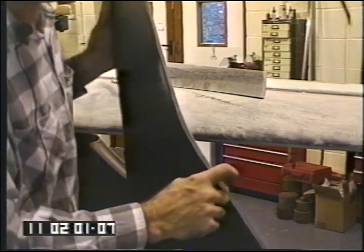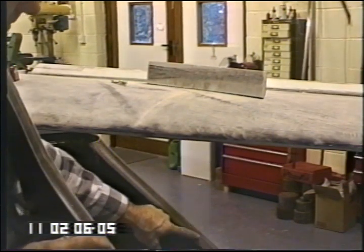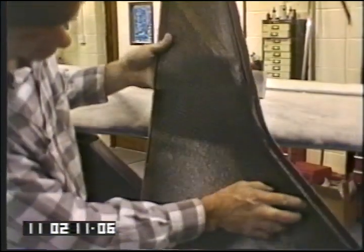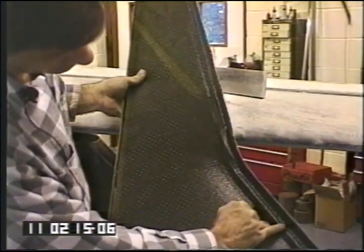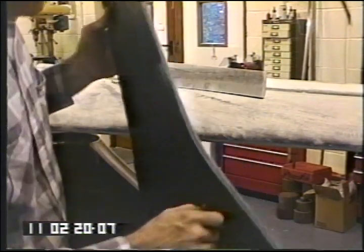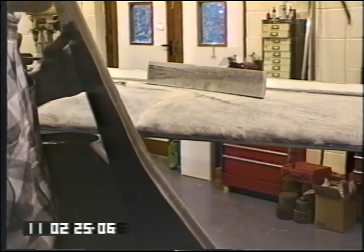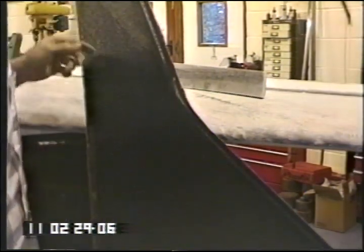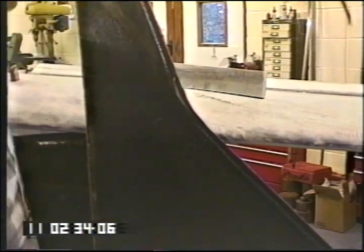That will abut that cleft, that edge, right there. So you have to have the distance from there to there exposed because it will slide down and go right up to the base of this foam. You need only about five-eighths of an inch. When you're all done, you're going to cover this whole thing with four plies of glass from well beyond that point to well beyond it on the other side. I'm putting twelve plies of glass in the middle of this bond. My next trim is going to be underneath that lip from one end to the other.